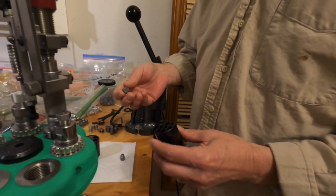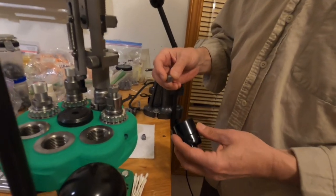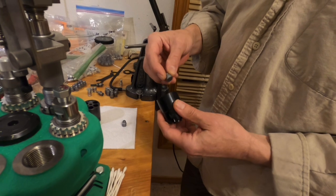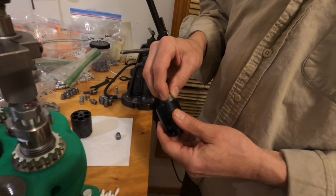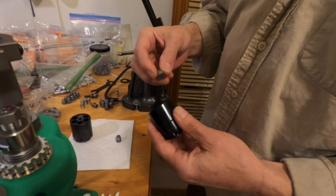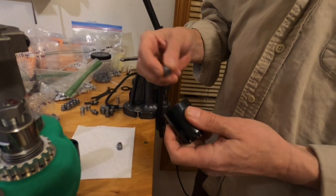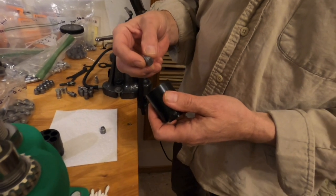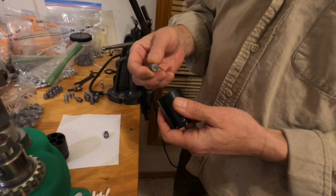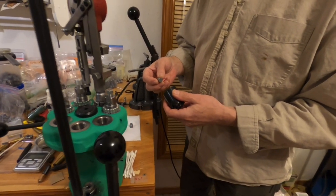I bought this .45 auto bullet for use in a percussion revolver, but it has no heel — so what are you going to do about it? These are sized to .450. This is a Pietta 44 chamber which is typically .447 or .449 — you couldn't possibly get that started properly on the gun. This is a Uberti which is .450, which is what I size to. I like to size my bullets at chamber diameter, no more than a thousandth over, because using these in paper cartridges you've got the paper in there too, which makes a slightly tighter fit.